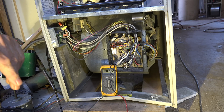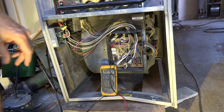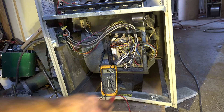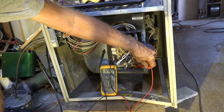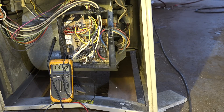The black and white wire coming down here — I'm going to go ahead and check that black wire and see if I have power there. I do have power; I'm showing 120 volts. So if there's power there, does that mean my 24-volt transformer has failed?